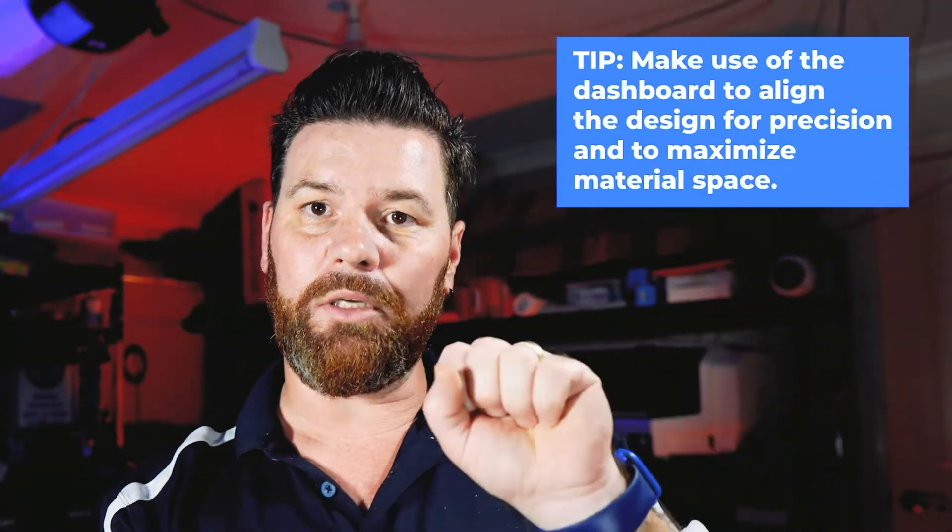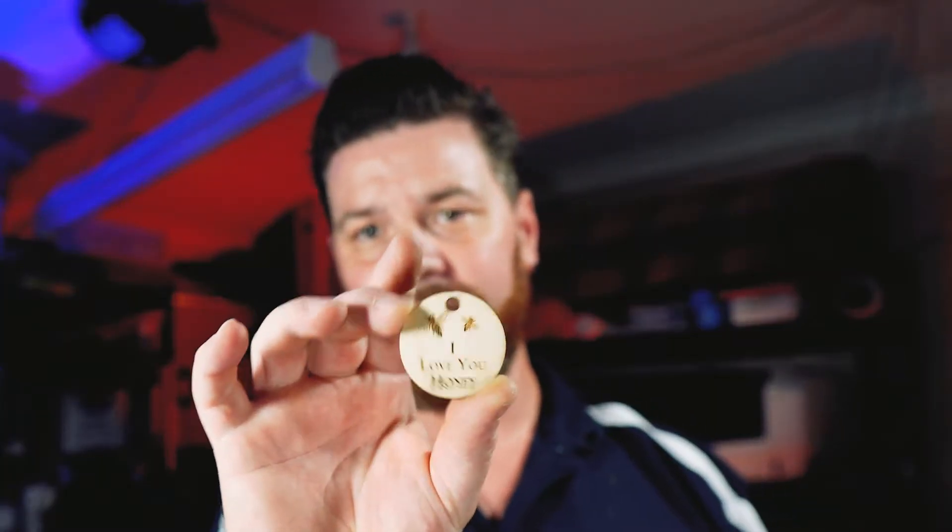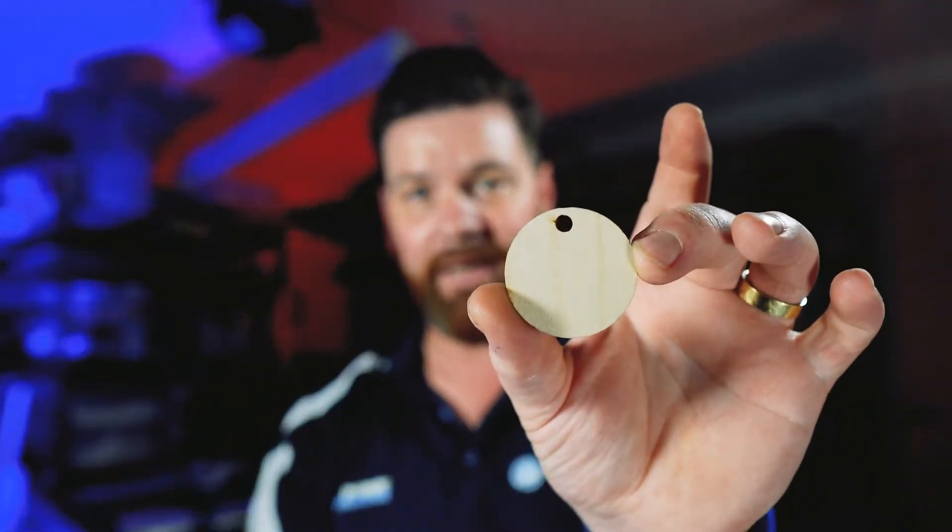So that's what we do — fire up the laser, send the data across, then jump over to the computer where we line up the design onto the bed. We used the word 'hello' but you can make whatever design you want. Put the piece of wood inside the laser, press print, and in the dashboard just bring the word over to where the piece of wood is, line it wherever you like it, and press print. You can get a little tag, sit it down in the hole, and repeat the word 'hello' straight across the front. That camera view feature is really cool — though it's not the most accurate. It's a couple of millimetres out, so it just depends on how accurate you need it to be.